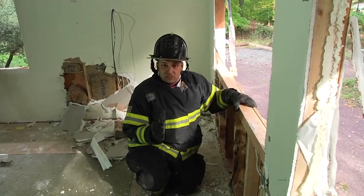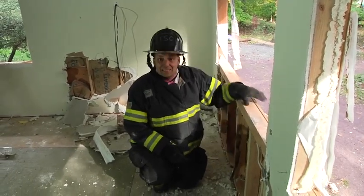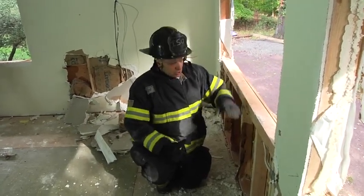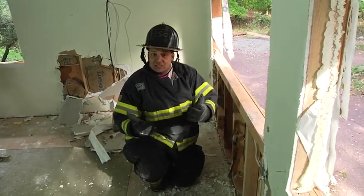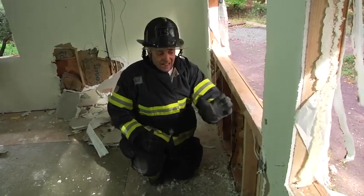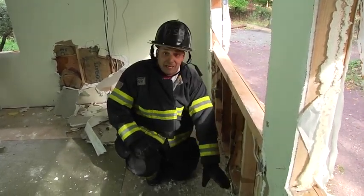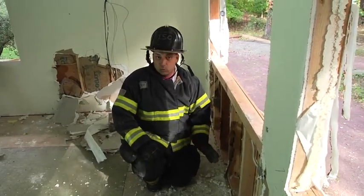Under a balloon frame type house, what's gonna happen is our 2x4s run past that sill plate, so it's not so easy. When you make those stress cuts, you still have the stability of that 2x4, so you either need to break the exterior sheathing away from that, but that 2x4 is still there, or after you've done it and you find that there is an issue, you now need to take your chainsaw and you need to cut across the bottom to get rid of that middle support.